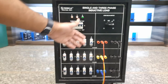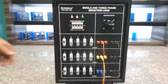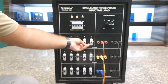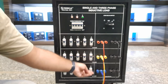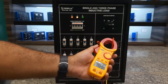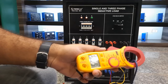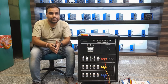At the first step all three phases are taking about 3.5 to 4 amperes. Each additional step will increase by approximately 3 amperes of rating. We'll quickly increase all loads to check maximum conditions for all three phases, increasing all steps one by one for balanced load. As ampere loading increases, the humming noise of the inductor loads also increases. Maximum reading on R phase: 18.60 amperes, Y phase: 18.4 amperes, and blue phase: 18.68 amperes.